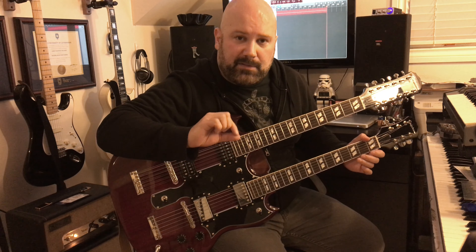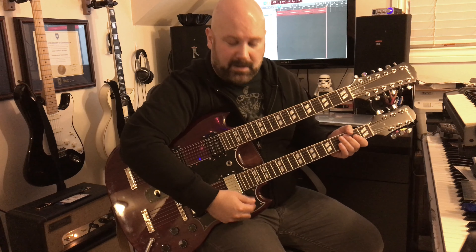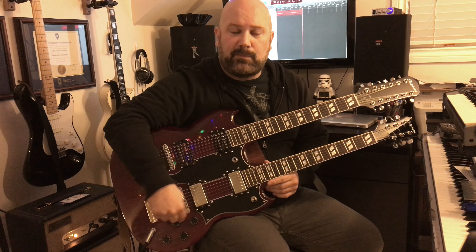Another important component Barry fixed was the switches. This guitar has three: one to select which neck is active, one pickup selector for the 12-string, and one for the 6-string. All three were junk — I'd get nothing in one position unless I gave it a couple of wiggles. So he replaced all three switches, replaced the output jack, replaced all four pots, and replaced the capacitors. We basically took all of the Korean wiring out and replaced it with quality stuff. The pots work very well and everything is quiet and noise-free.